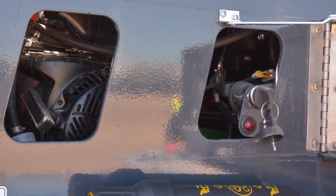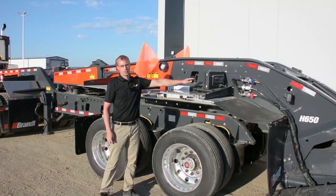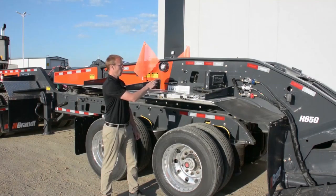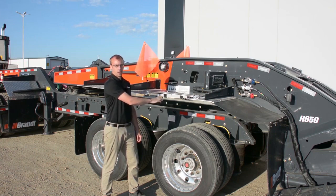Remote mounted to the edge of the control box is the key system to start and stop the engine, so your operator should never have to climb up on top to pull a pull cord to get this engine started. We've installed a light inside the control box so your operator can easily see what he's doing even when it's late at night. We've also added an external drain line so when you're servicing this engine it's very easy to access and perform that maintenance task.